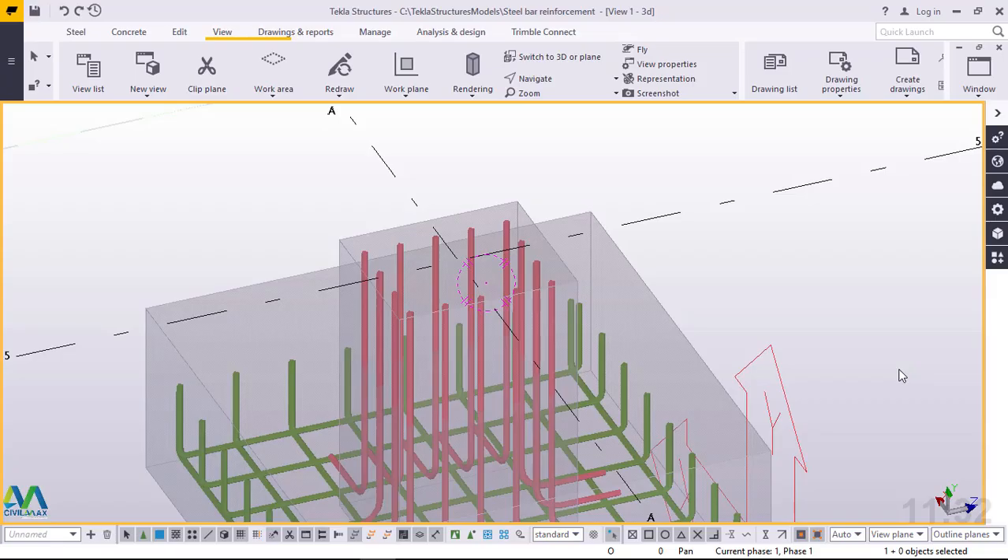Hello, I'm Maurice Dimba and welcome to this tutorial. Today I'm going to show you another way of arranging a set of ties with four pieces of ties inside a concrete column. Remember the term 'tie' is used to define the transverse reinforcement provided in a column where the primary mode of load transfer is compression.